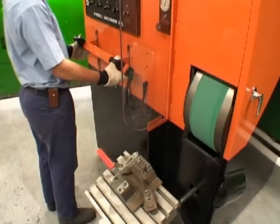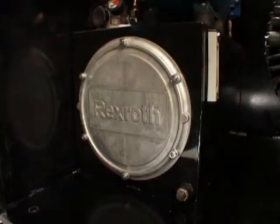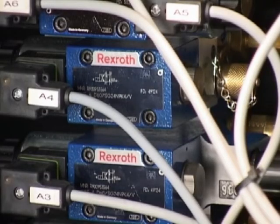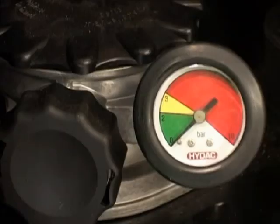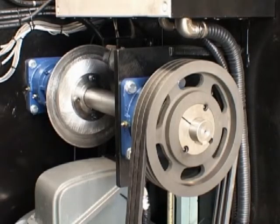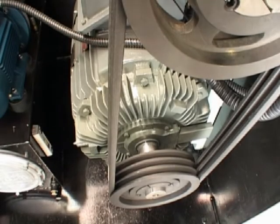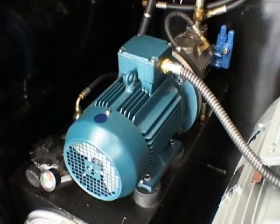If the operator releases either cycle start button, the machine goes into recovery mode. The RGS Plunge Rise and Fall machines have been designed and manufactured with components available in all western countries to ensure minimum production loss in the event of component malfunction. Power to all moving parts is supplied by an inbuilt hydraulic power pack. Installation needs only electrical power — no expensive pneumatics.